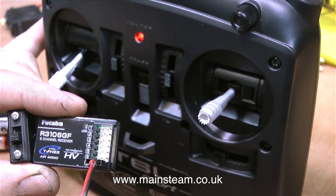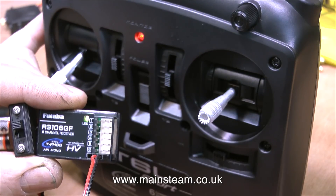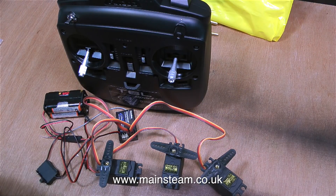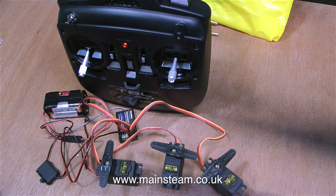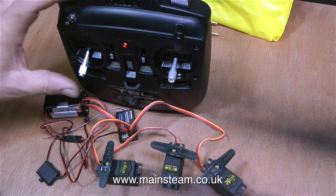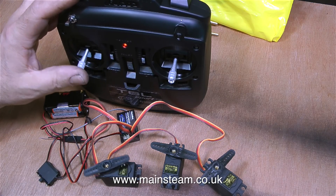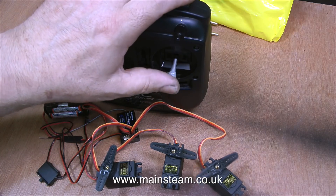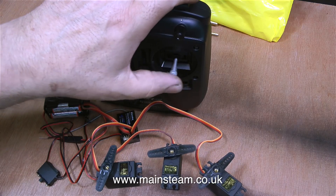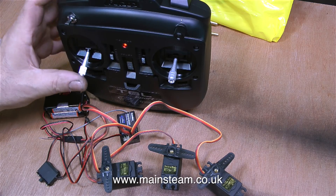When using a radio control system, whether old or new, the protocols must be observed. You always turn on the transmitter first, followed by the receiver, and when you finish, turn the receiver off first, then the transmitter. If you turned on the receiver first, there is a chance it could lock to another transmitter, the servo ranges would be entirely wrong, and the servos could be damaged. So don't forget — transmitter on first, followed by receiver; when you finish sailing, receiver off first, then the transmitter.